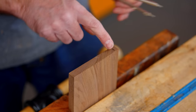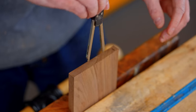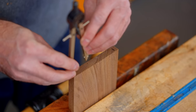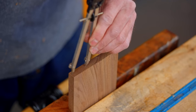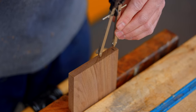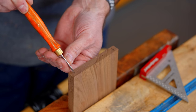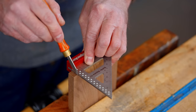I want to go three swings and land on that line, so it takes a couple of tries. Once I have my dividers set, I'm going to make an indentation with the points — one, two, and three — and do the same thing from the other side. Then I'm going to take a marking knife, stick it in the hole, bring up my square until it touches the knife, and scribe a line, doing that with all six holes.